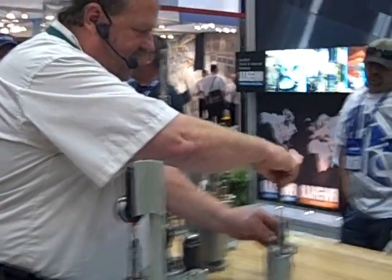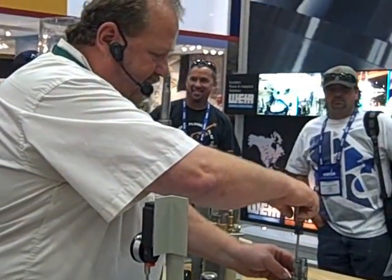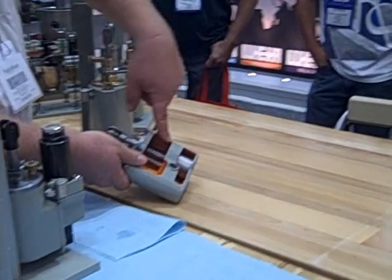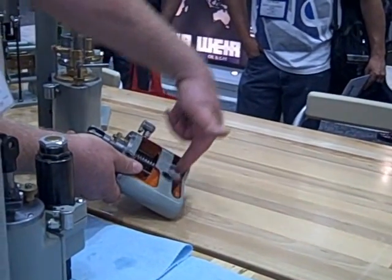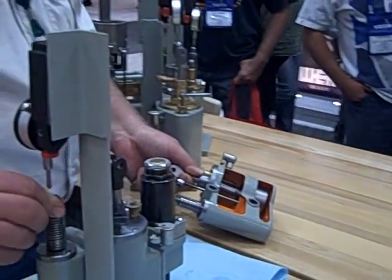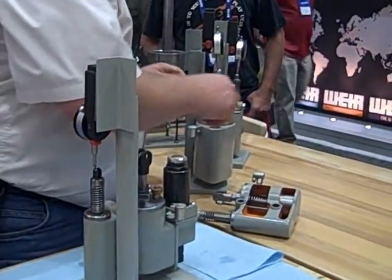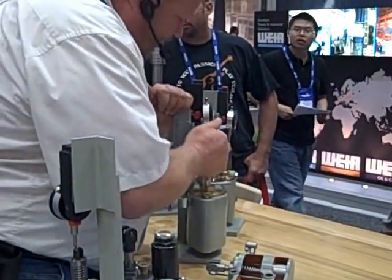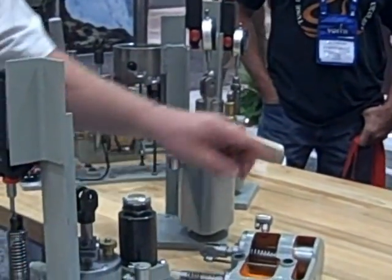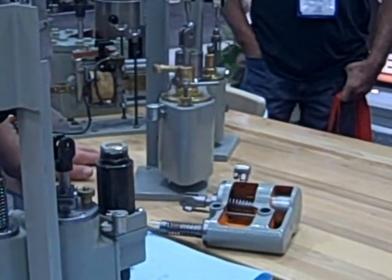They're all adjustable with a little needle valve right here. What that little needle valve does is it makes an oil passageway to relieve the pressure in the bottom. In other words, this would be like a liquid-filled shock. If I move this little plunger here or this big plunger here, you can see the other side moves. The amount of movement you get out of the other side depends on the opening of the needle valve, which means you can adjust the dashpot for the amount of stiffness needed.